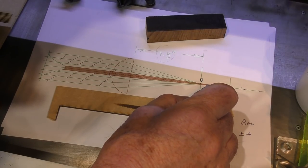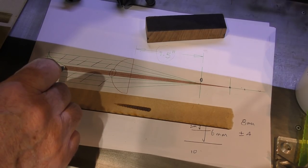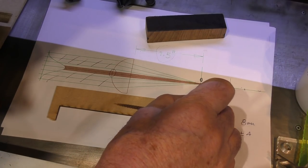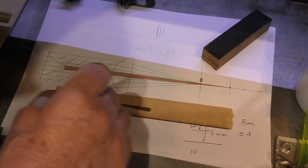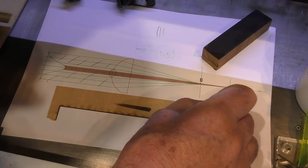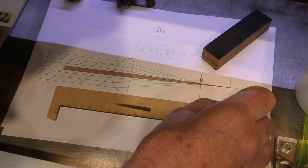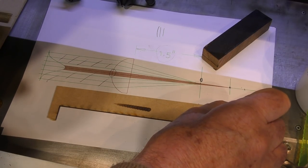Cutting basically relies on two factors. Number one and the key factor is the intensity of the light that you can fire through the lens, and the second is how long you need to keep that intensity in one place to do damage. But focus also determines depth — I could keep this on for a huge amount of time but I won't be able to cut any deeper than this depth here because I don't have the focal point to carry the power. If I want the focal point to carry the power I've got to have a longer focus lens.